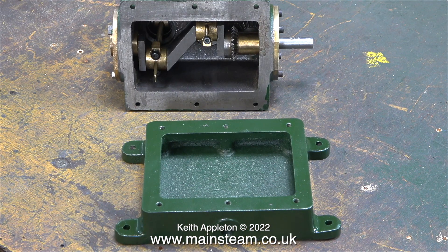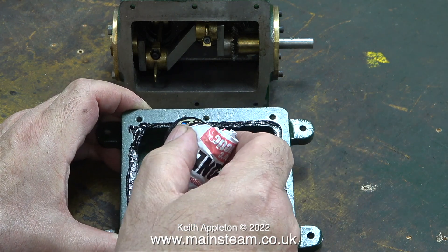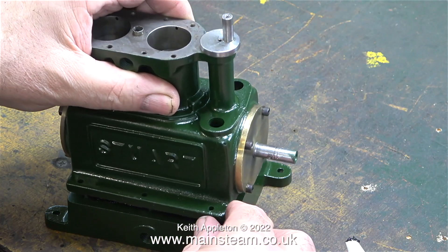It's time to fit the upper part of the engine to the base, and for this I need to use a sealant, not a gasket. A lot of regular viewers will notice I'm not generally a fan of silicone rubber as a sealant where steam engines are concerned, but on this rare occasion it's perfect. I applied the silicone rubber sealant on the inside of the edge of the base so that when the top part is bolted down, it won't be squeezed out and won't be visible.